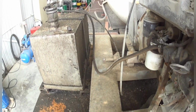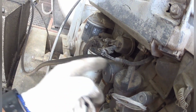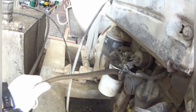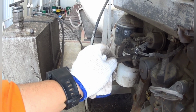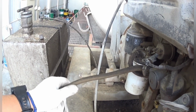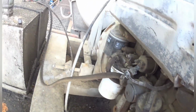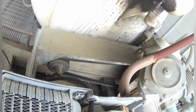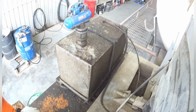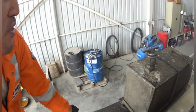The problem is this diesel pump has no pumping, and the diesel is down, so sometimes there is a little hole and an airlock comes in. That is the problem. So I want to put the tank here at the top. This one is a fabricated tank, because the issue is the tank always leaks at the cup. So that's why they changed this tank.